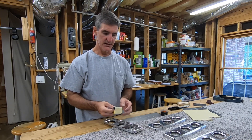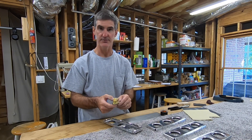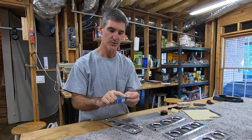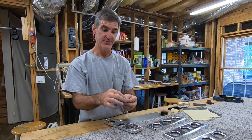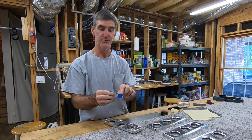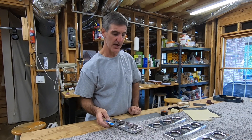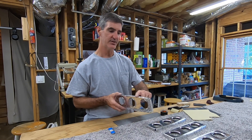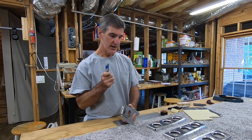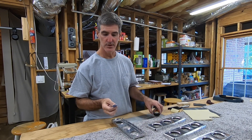And man, that worked perfectly. Sandpaper wears out — you just pick a different piece, just a tiny little piece. I thought that worked really well and I'm going to save this thing. It was kind of convenient where the tape was — since it was rolled up backwards, it was sticky and the sandpaper would actually kind of stick to it where it was exposed. I'll probably try and redo this and expose a more sticky area of the sandpaper next time. Although these are the last six ribs I need to do this to on the empennage, so I guess I'll save this for wing ribs. I'm sure there'll be other little nooks and crannies I need to get into. Anyway, my tip: use tape and make a little form-fitting, cushioned, radius-following sandpaper holder.